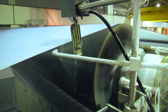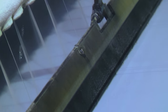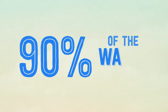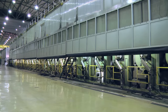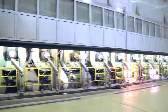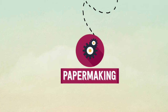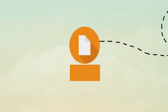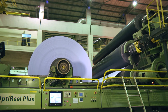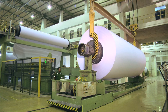Moving at almost 90 kilometres an hour, the thin mats are fed into the press section, where up to 50% of the water content is squeezed out. Up to 90% of water in this entire manufacturing process is also recycled. Things then start heating up as the sheets are dried at above 100 degrees Celsius over a series of cast-iron cylinders. But the journey for premium quality paper doesn't end there. A film of chemicals is applied to the surface of the dried paper to improve the properties of the paper before being wound onto 8.5 metre wide jumbo reels.